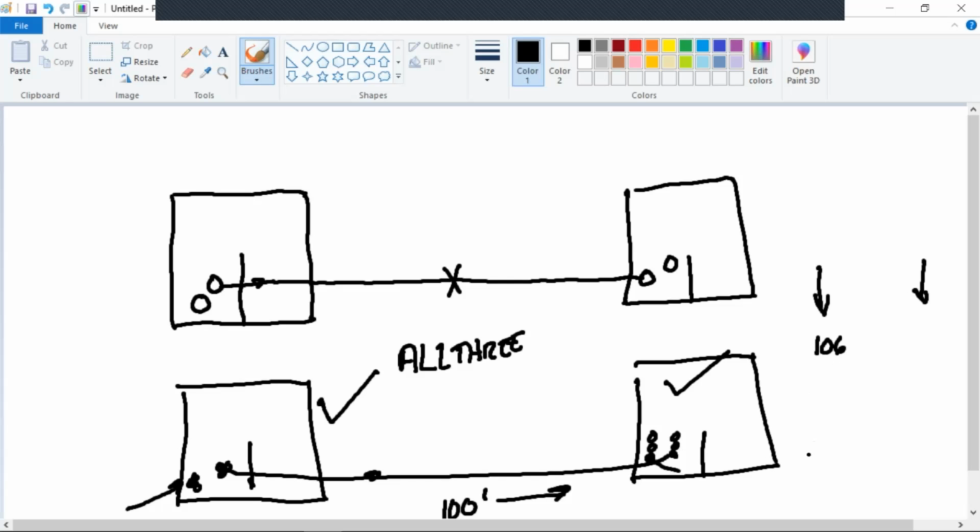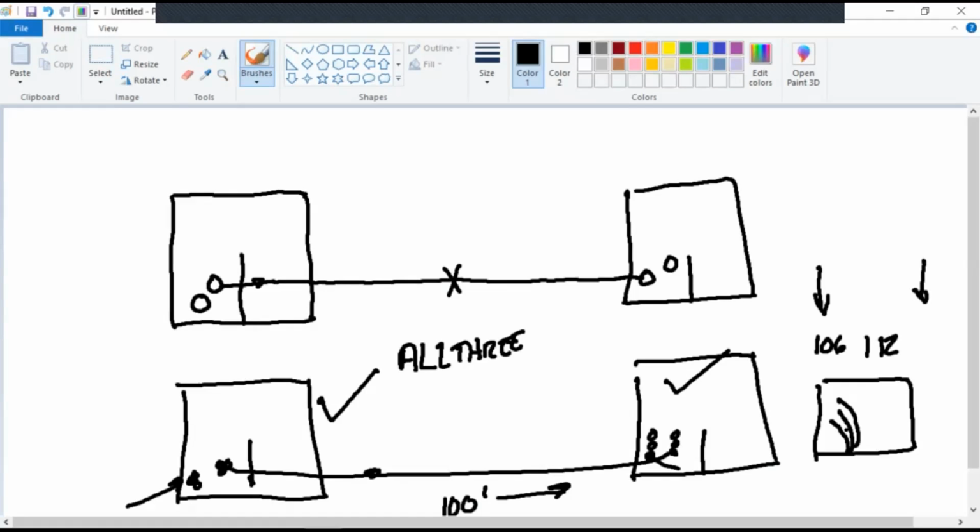How high in the air when you look inside the transformers? About 3 feet. How high in the air does the wire go? 2 or 3 feet. So there's 2 or 3 feet more each side. So we're going to add another 6. That's 112. And you want extra. So I'd say, yeah, I need 130 feet of wire. You come over here to the one that's in the same conduit, that's 130 times 3. That's 390. Yep. Plus all your terminations and all. Yep. So, or 400. That's expensive. Compared to that, 15 kV underground primary runs around $2.67 a foot.